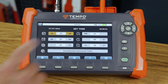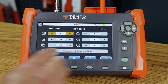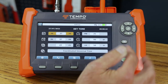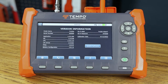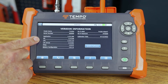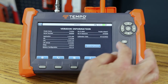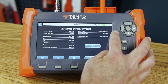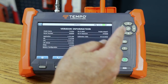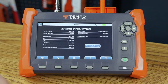In time and date settings, the TV220E has fields for day, month, year, time zone, AM/PM or 24-hour format, and hour and minutes. In the information screen, we display the model number, serial number, and all software version numbers for the application, operating system, measurement controller, FPGA, and battery configuration. We also display the Wi-Fi SSID and password — those features will be enabled later — along with the calibration date. If a valid software update file is on the USB drive, the TV220E will enable the update software button for field updates.